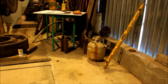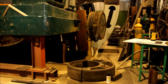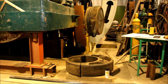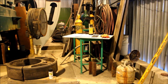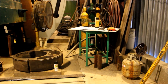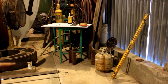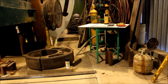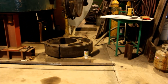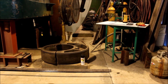The form for the engine will come back and there will be like 3 steps - it will step down to the elevation of the top of the wall up to the elevation of the bottom of the bed plate. All that will be filled in with concrete and rebar and doweled in. This little bit of extra depth acts like a concrete beam to help tie both sides of the engine together so that with this very shallow foundation we still have enough rigidity in it.